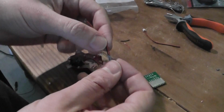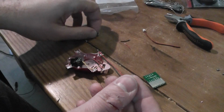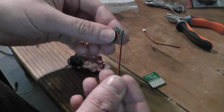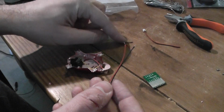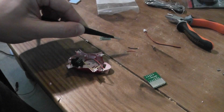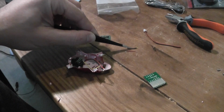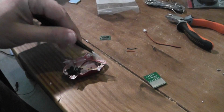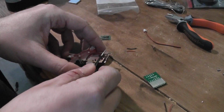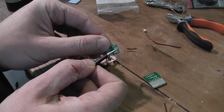Okay, I prepare the first cable. So ending with the male, I will install it on the step down. Okay, on the V input of the step down. So it will be the first ground, and I cut two very tiny cables to link with the video transmitter. So I need only a short one. So I will share the ground with this one, and also share the ground with the input camera, the black here. So you need to install 3 ground wires on the ground of this step down.